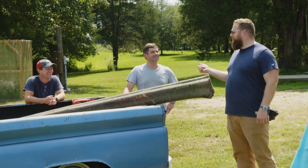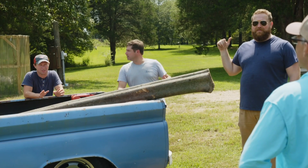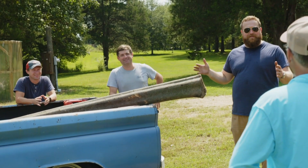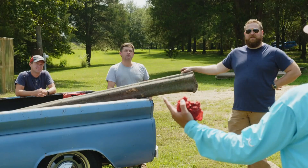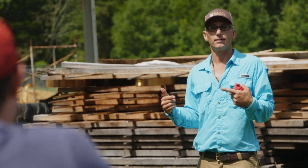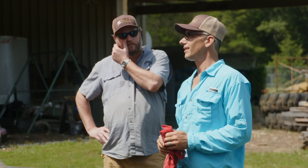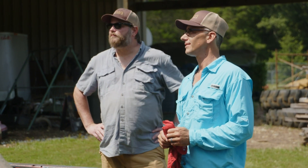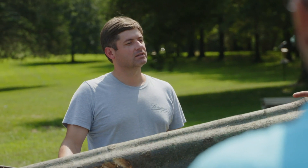So I was trying to explain to them what a dry kiln is. You got pretty close, but it's a vacuum — your water will boil at a much lower temperature under that pressure than it would at your stovetop. So that's how we can dry really quickly with a little less degradation. So let me explain: these homeowners are from the Pacific Northwest, and they are obsessed with Hobbit furniture. So what we're wanting to do here is get this dried and use this tree somewhere in the design.